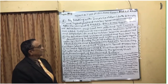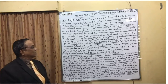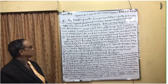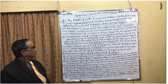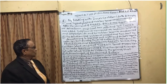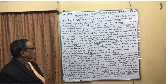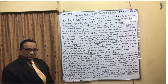The rubber becomes completely devulcanized. Point five: The devulcanized rubber is washed and sent for dewatering to squeeze out the water, then dried to the requisite water content. Finally, the dried rubber is mixed with processing and reinforcing agents such as clay and carbon black — known as reinforcing agents — which are added to the rubber.